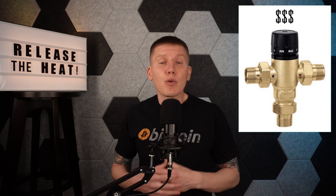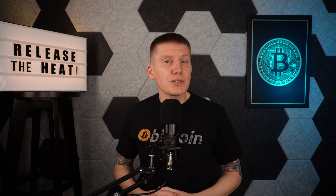This is a really neat way to prevent your miner from freezing in the winter, but there are some downsides. Thermostatic valves aren't that cheap, and the ones with really high flow rates are even more expensive. Also, they often don't completely close off either the hot or cold inlets when operating at their extremes, which might affect your cooling efficiency during the hot summers — so you might have to add an additional valve to completely close off that bypass route during the summer. But adding this to your cooling loop might be a great help in keeping your miners from getting too cold in the winter.